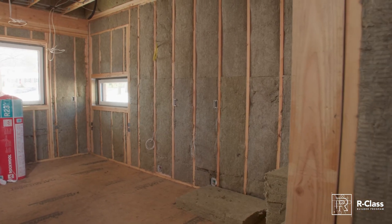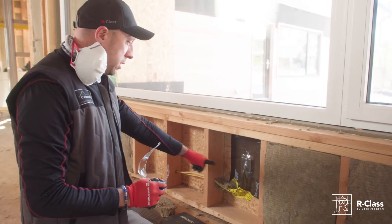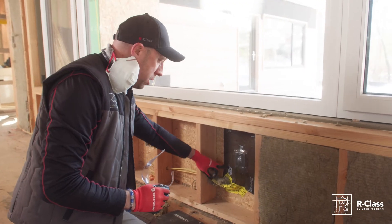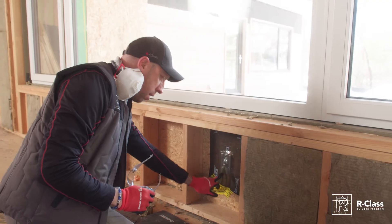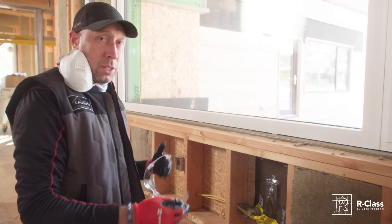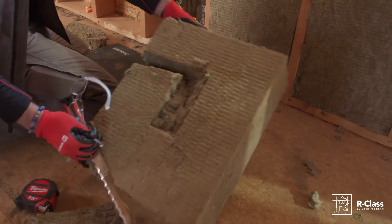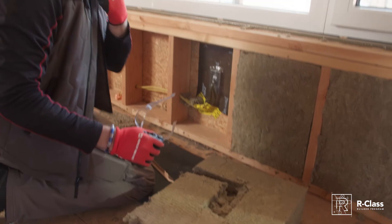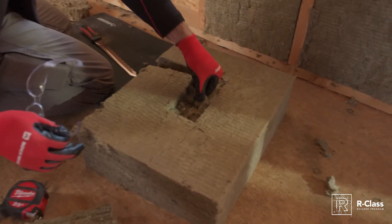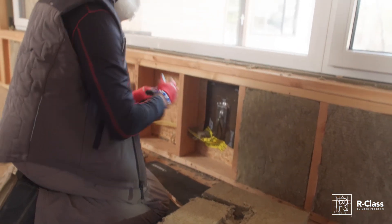One of the nice things about Rockwool is that instead of just having a simple bay with a wire spanning across, here we have a box sticking in from the exterior by half an inch, then the wire with the strain relief sticking in another three quarters, then wrapping around, then tape — all these things that are not just a split batt. Because of the density of the material I can cut and shape it just like a piece of wood. With the ability to measure to a set point and cut out exactly as much as I need, this is going to be a great fit with contact against the outside sheathing.